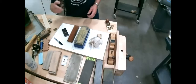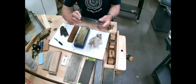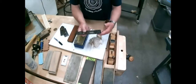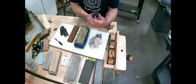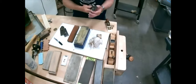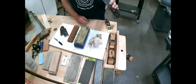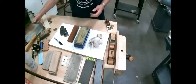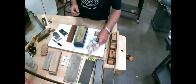By the way, this is the old-fashioned kind of blade — they were tapered from front to back. Today's blades are not tapered. This one fits in a European coffin plane, and they were also often tapered from top to bottom, which makes it difficult to square the edge. This is from an old Scottish company called Matheson, famous for very high-quality planes — I found it for about two bucks. Let's turn to chisels, because sharpening chisels is much the same deal.